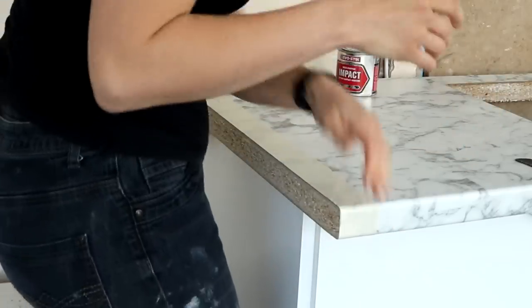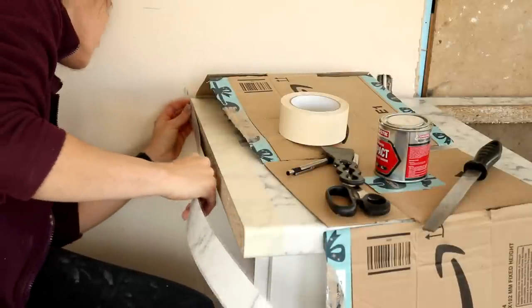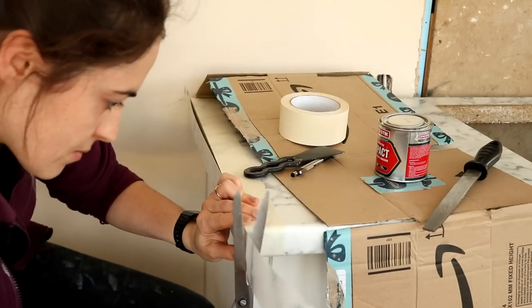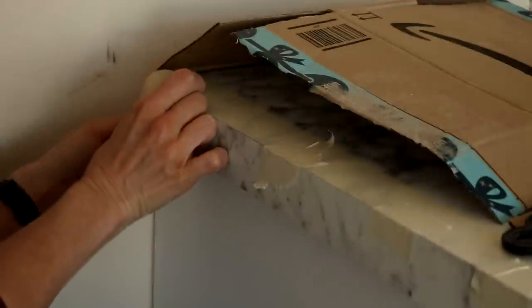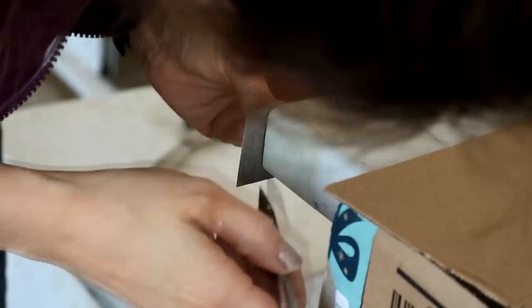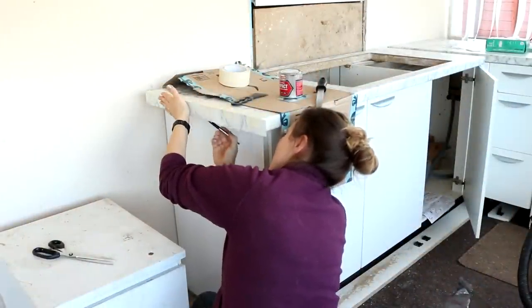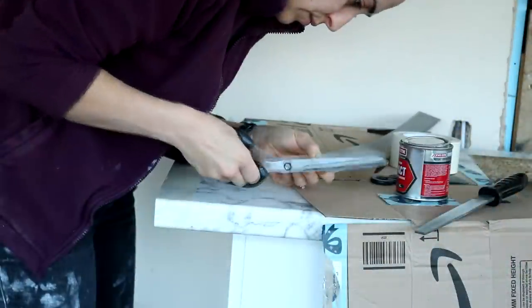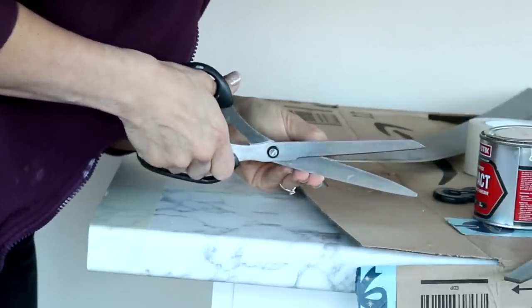The first thing I'm doing is masking taping it up again. I also protected the rest of the worktop with cardboard. Then I got the pristine laminate edging, made sure the top of the trim lined up with the top of the worktop and lined up with the back. Once I'd trimmed it down with a pair of scissors, I temporarily attached it in place with a few bits of masking tape, making sure it's still lined up as you go along. Using a sharp pencil, I drew around the excess bit at the back and the bottom lip, so I have a clear pencil line of exactly where I need to cut.